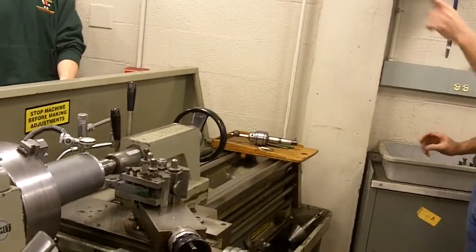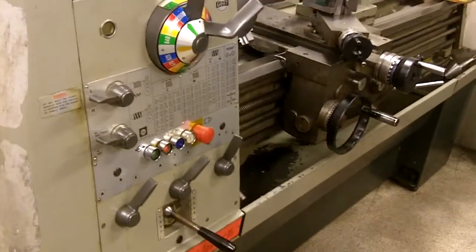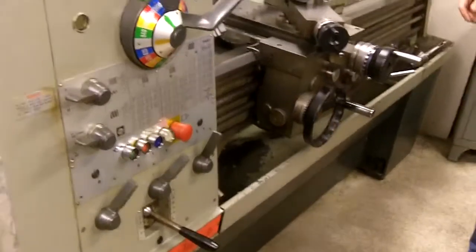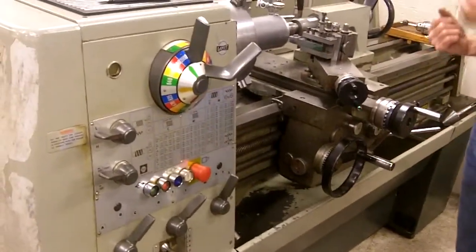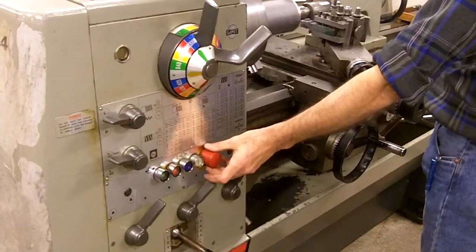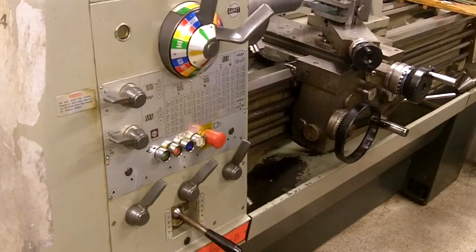Firing up our machine. You can look at the ones behind me — somebody take charge of your control panel and gearbox. We can start all three of these lathes and you can look on as I talk you through it. On our gearbox we have our chart, our gear controls, and our red buttons — red buttons are our stop buttons. To start this machine, you pull the red one out a little bit. If you're gentle, it'll pull out and stay out.